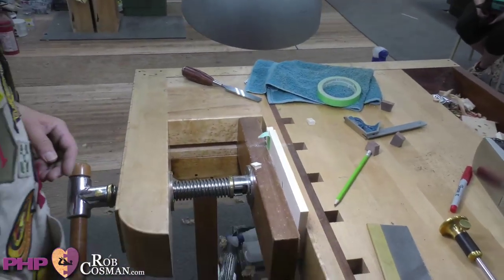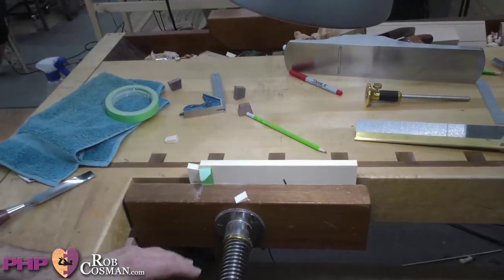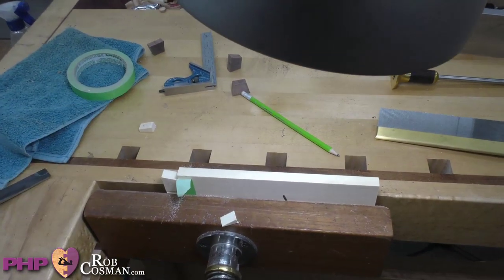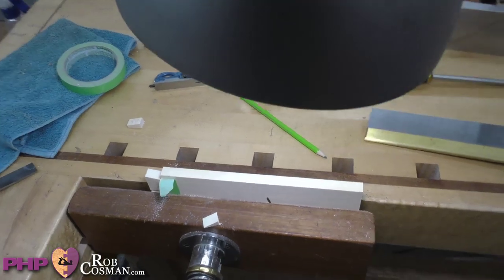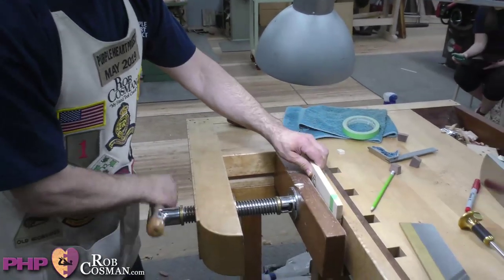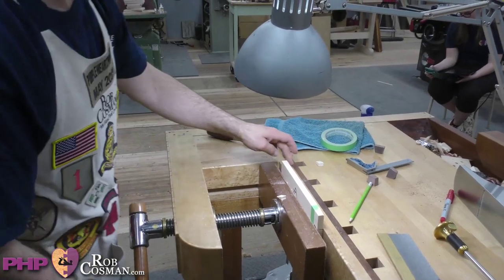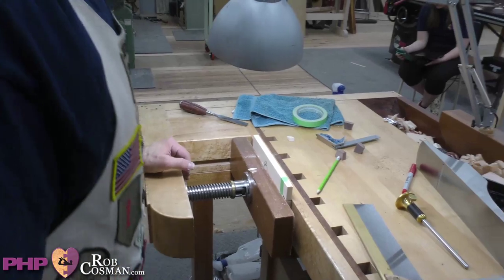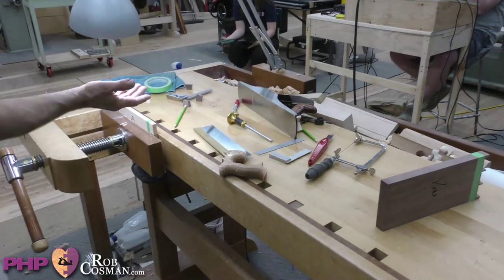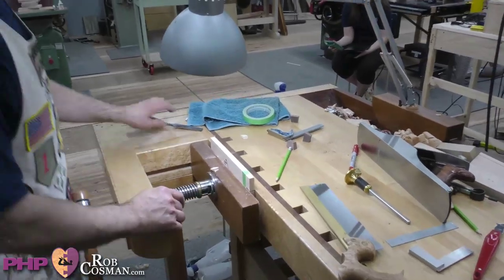And in case you're wondering, my racing stripe on my bench, do this, Jake, sight down along there. So when I put a board in like this, to know that it's level, I just sight right along the top of this with the top of the racing stripe, and that shows me when I'm level. Now, that started completely by accident, because the first time I did that on my other bench, I developed a crack right along there, right after I built it. So the only thing I could do to salvage it was to run a router down through there and glue in a piece as an accent piece. And then when I discovered its use, it's like, oh, wow, this is perfect. What am I doing? Oh, this side.